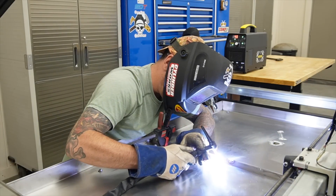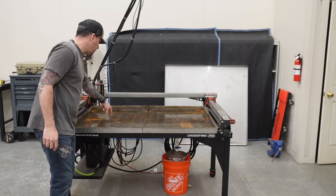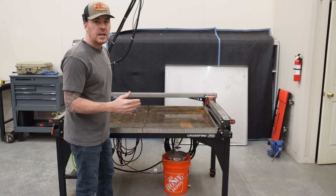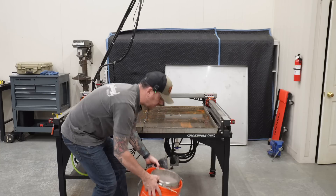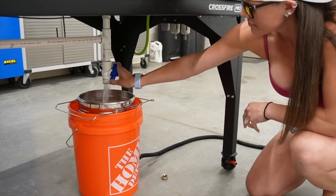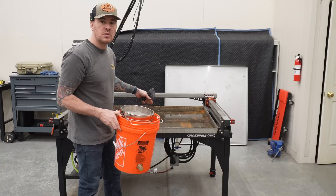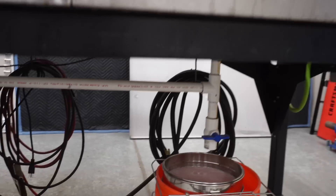The big focus was on that water table. I TIG welded that seam — I just started learning so I did a job. I TIG welded a couple of three-quarter inch fittings on the bottom side of the water table and installed the drainage system underneath here, along with a five gallon bucket and a strainer to strain out all the crud and junk. This little setup actually works pretty well.